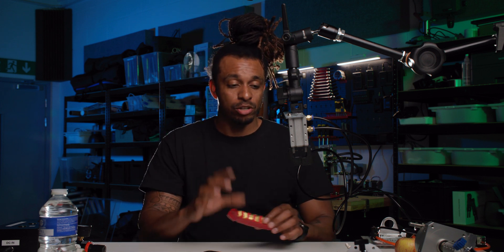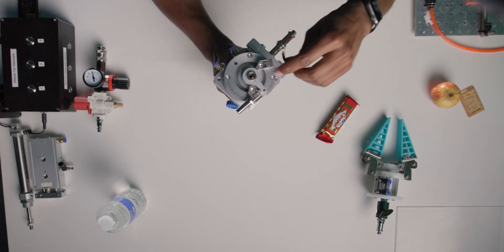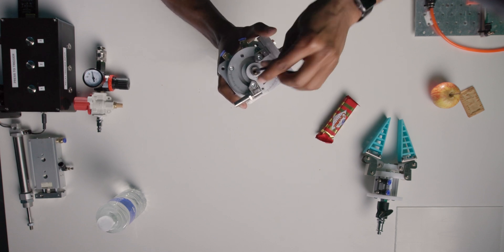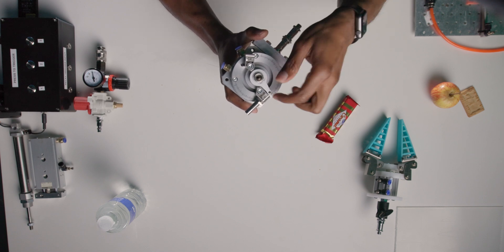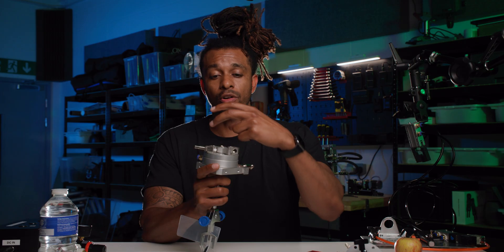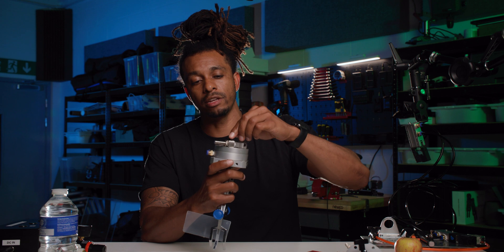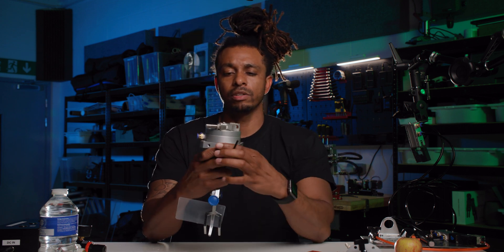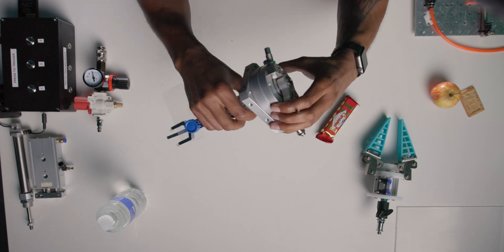Sometimes that's just an extra hand you don't need to have a person for — that's the fun of visual engineering and repeatability. Devices like this give you a lot more control over your shooting. Looking more closely at the rotary actuator: you can see the bump stops here — this is the total range of 270 degrees of rotation. You can adjust the bump stops to any position to restrict or confine the motion of the drive between those points, then just tighten them down.